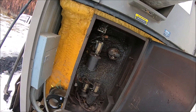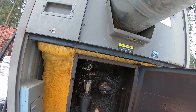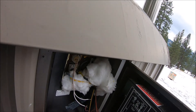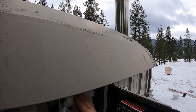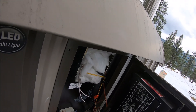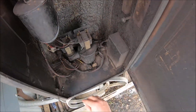The clunk is the solenoid that opens back here. Any time you open the door these two will open, and this one will open only for fire — when we need to blow air in there to get it going. At this point the temperature is still plenty high so it will not try to reignite the fire. It will just do the clunk when I open the door and then shut off again shortly after.